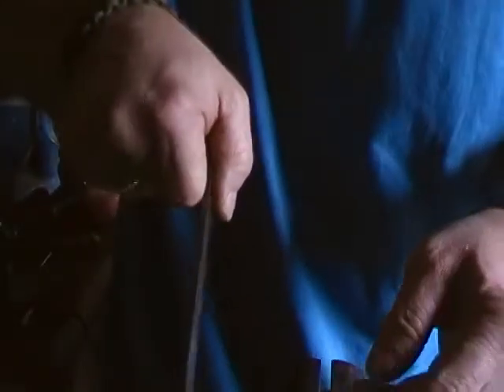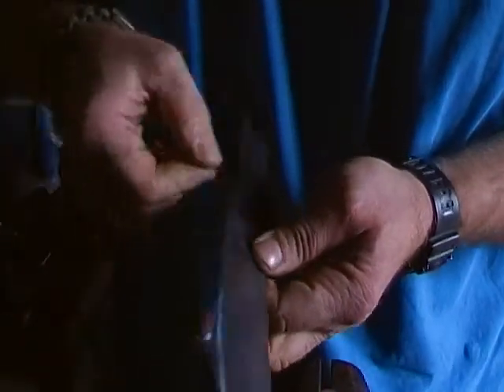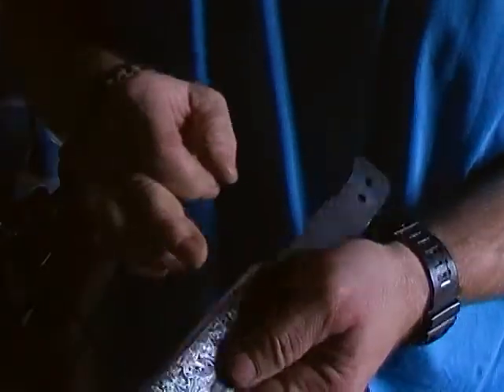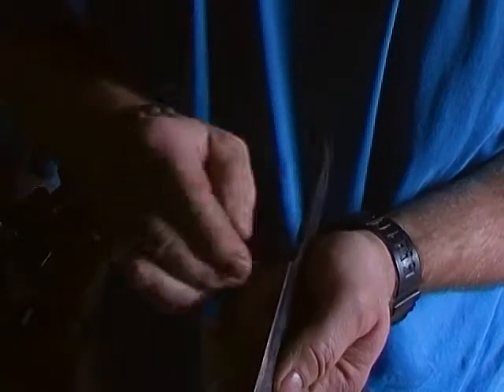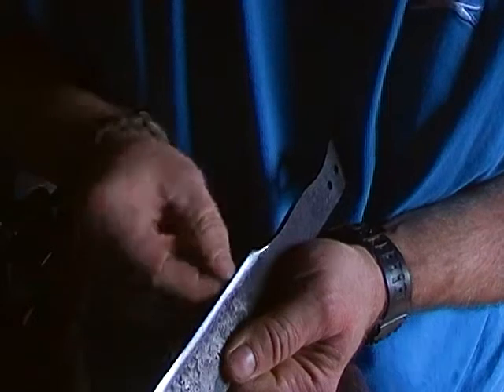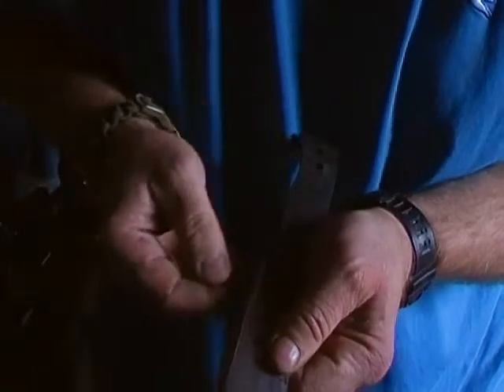This isn't finished yet — I didn't want to do too much work with it in case it snaps or bends. The nail test is something I was shown years ago. Basically what I was told is if the blade's too hard it'll chip out, and if it's too soft the edge will just roll over. I tend to try and get my blades to where they're more likely to chip out than bend or roll over, but this one — I can't feel anything on it, so I'm quite happy with that.